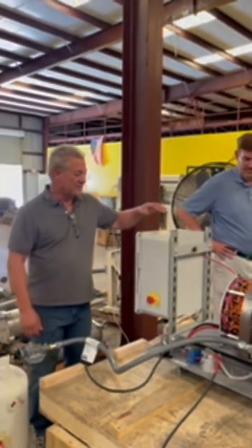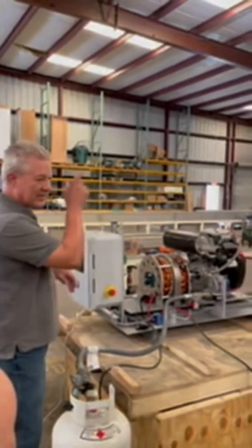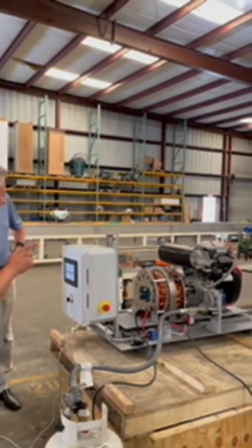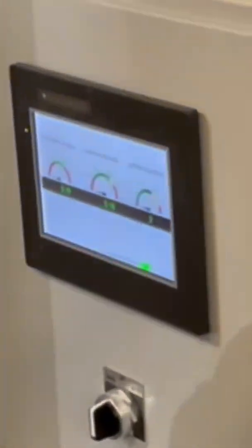The way we've devised this system, we have logic control in here that makes this into a battery charger, so the batteries will then be feeding an inverter. This was actually set up on that previous unit you saw sitting on the bench — it's set up for high voltage. It references the battery bank voltage and the generator voltage, and when tied to a bank of batteries it reads the data in from that battery bank voltage and says 'I'm down to 60 percent, time to charge it back up.'